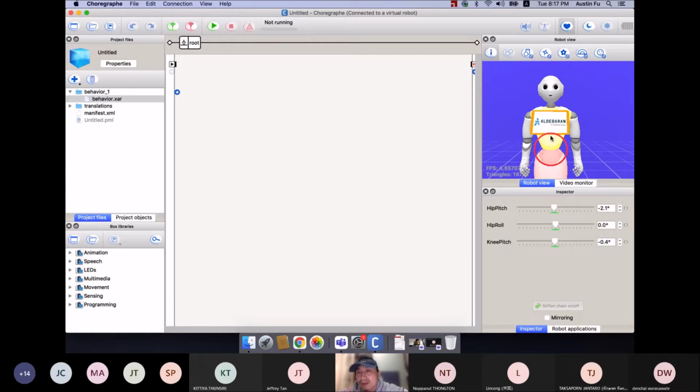You can use these degrees to choreograph a dance or make the motions more like a human. So that's why we call Pepper a humanoid robot. Also, in the head, we have three sensors. We call them touch sensors. We can use these sensors to accept events from the outside. Like once you touch Pepper's head, it triggers an event to your program, then you can capture this event to run the specific program you want.